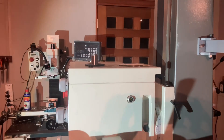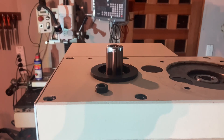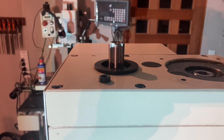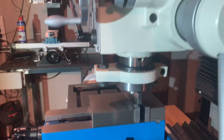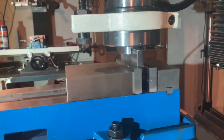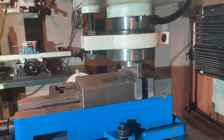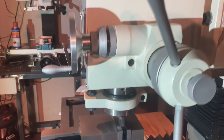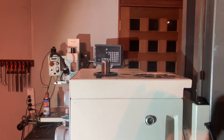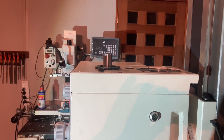I've got the motor off, so now I've got plenty of room to tap that thread into the spindle. To stop the spindle from turning, there's a little notch in the spindle and I've got a piece of plate that fits it, and I've clamped it into the vise. As you can see, that'll stop the spindle from turning as I try to cut the thread. I'm going to get the phone on a tripod and then start cutting this thread.